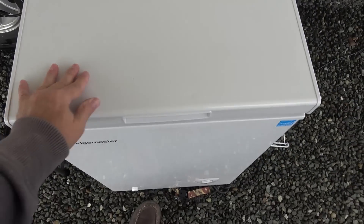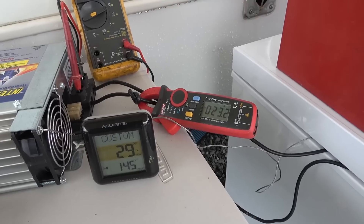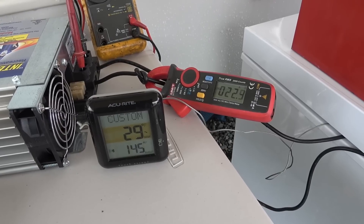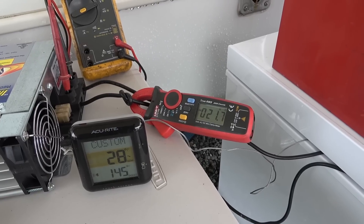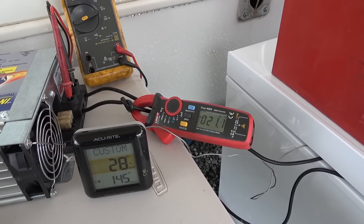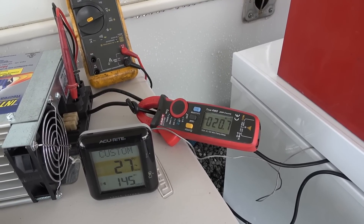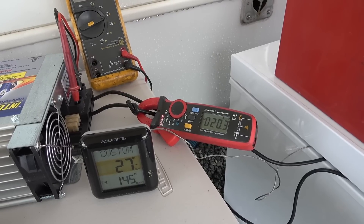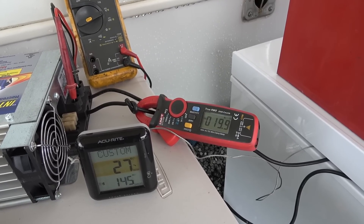Hopefully the wires won't interfere with the seal too badly. So we're charging, putting in 22–23 amps, and right now the probe reads 29°F. The battery management system is supposed to shut off when the cells drop below 32°F — but that's inside the battery where the sensor is, so we'll let this continue and I'll let you know when it triggers off. Charging is actually creating heat inside the battery, so it might handle lower than 32°F by quite a bit before the internal cutoff is reached.